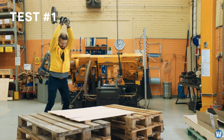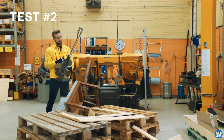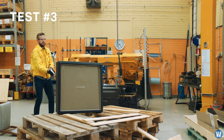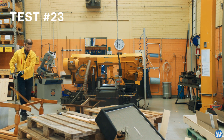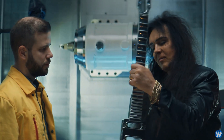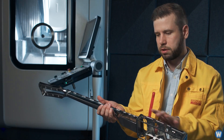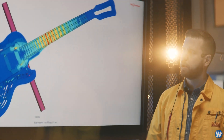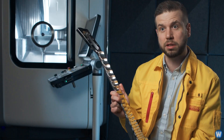Sandvik had to design a guitar that is unsmashable in all the different ways you can smash a guitar. The engineering challenge was to overcome that critical joint between the neck and the body, which usually cracks on a guitar. Engineers overcame this weak spot by eliminating that joint — instead, the guitar's neck and fretboard were milled from a solid bar of stainless steel as one piece, a guitar construction technique that had never been tried before.